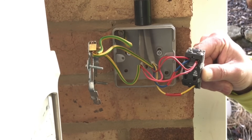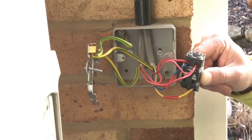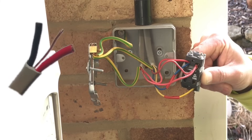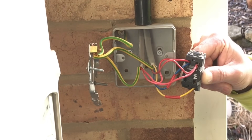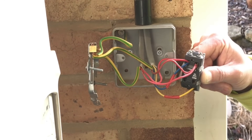I would have preferred it to have been red sleeving, but that's what he's done here. Often the switch wire down from the light fitting isn't in twin red — it's often in red and black, and if it was, the black conductor would also need to be identified with red sleeving. So that's what we've got at this arrangement: twin red coming down from the light fitting and three core going off to the other switch. We've used yellow as common and identified both blue and yellow with red identification tabs.